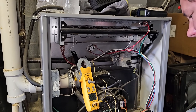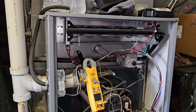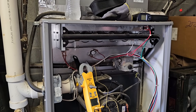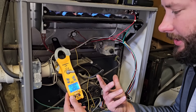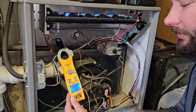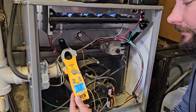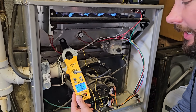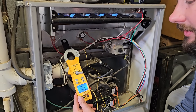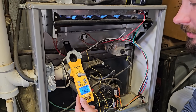I'm going to put this door back in so we can close the switch. The fan hasn't kicked on yet. It's 226 degrees, 235 degrees, 242 degrees — so it's definitely getting really hot. There goes the fan. Immediately it starts cooling it down. Now it's below 190. Now let's see how long it takes to kick it out and figure out what the temperature is.